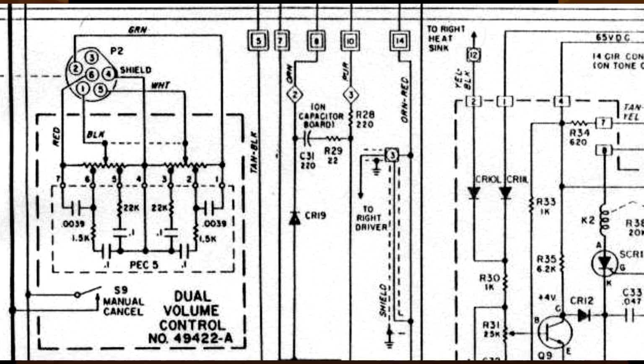Looking at it, I don't think it's vital that circuit is there. I can probably make do without that, which does mean that I can just use a standard dual gang potentiometer. I mean, I don't know what value. I'm going to guess something like a 10k linear dual gang. That should do the job. I'll try making up something like that, and at least it gives us a stepping point to power the thing up and see if there's any life in it.